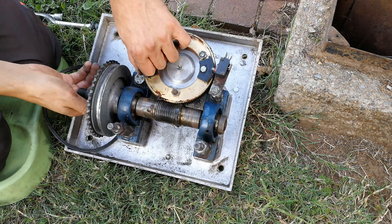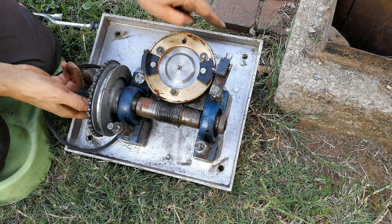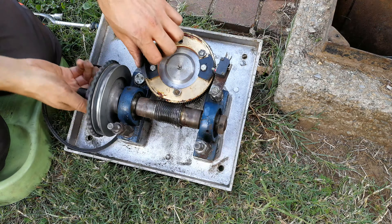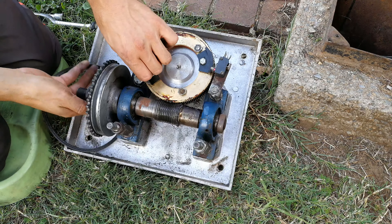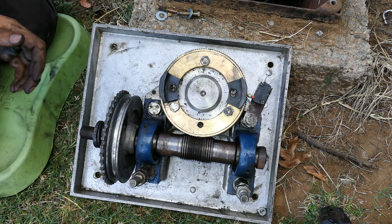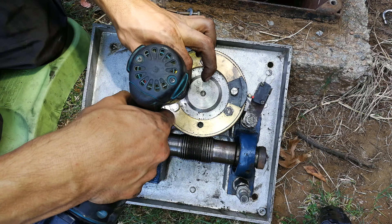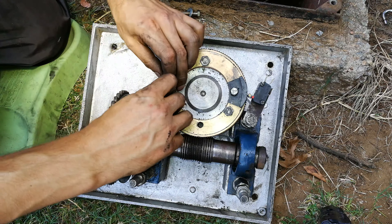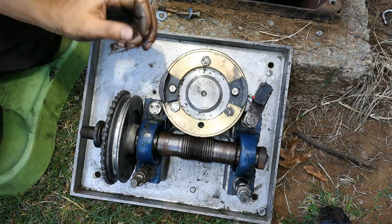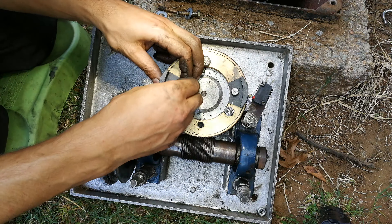That's not supposed to have any free play. So what I'm going to do is, instead of traveling from there to there, I'm going to let it travel the other way around, so it uses the new part of this brass gear. I've swapped these around so I can use the other part of this gear. Just make sure when you put this on that it sits in the little recess — there's an edge here which must go into that. Mine is a bit worn so I'm going to put a little washer on it so that it sits nicely.